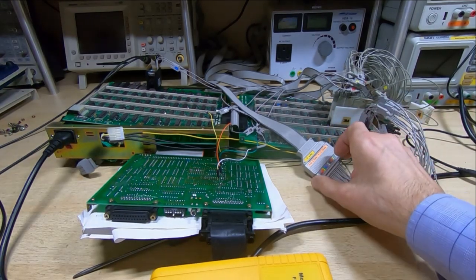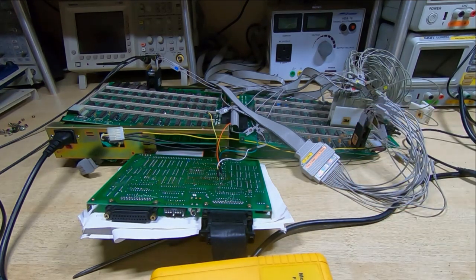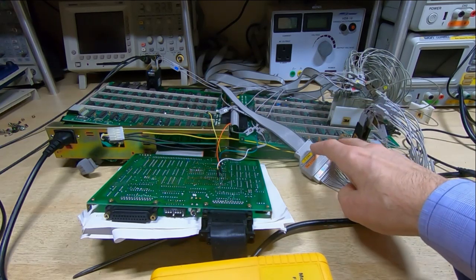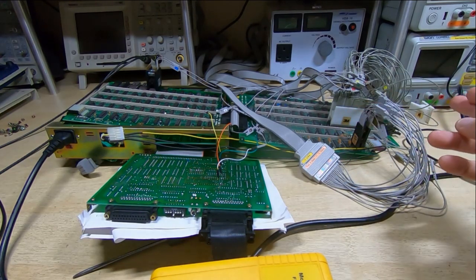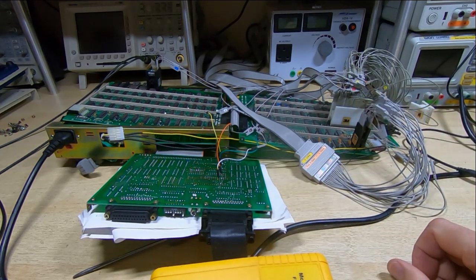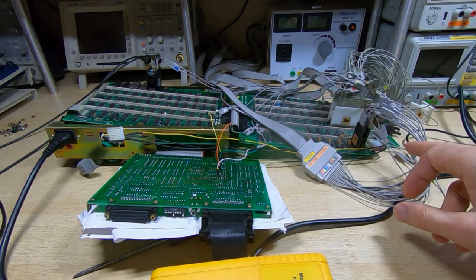So it had a lot of hardware faults, and the first thing I did when I took it apart and looked at each board was try to figure out what each board was. In general terms it's fairly easy to do that, but I was trying to figure out how to go about fault finding on this, because they are quite complex. As an example, this has got onboard RAM that you can use for running the code in your target system. Not only that, but you can map the RAM in 1K chunks between the target system and the emulator. So in other words, it all seems to be 64K continuous memory, but the 1K blocks could either be on the emulator or on the target system, so you can replace one K block at a time. But that makes it quite difficult to fault find on, because if there's a fault in that mapping, then trying to get the code to do what you expect is quite tricky.